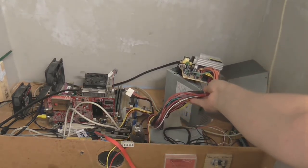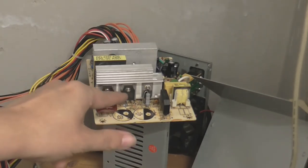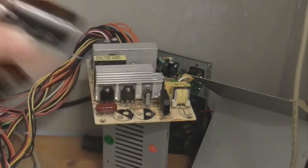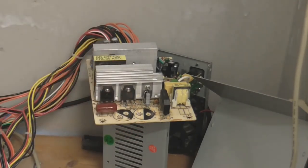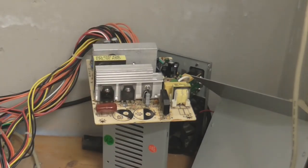You can see here the power supply that I've opened up carefully — here we see the guts of the power supply. My first suspicion was that one or maybe all of the switching transistors had gone bad, so I decided to test to see if they'd gone short-circuited. I pulled out the two main capacitors to get to the transistors, and I went through with my meter. All three of these transistors have tested okay, short-circuit-wise.